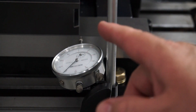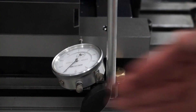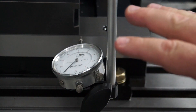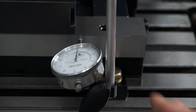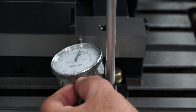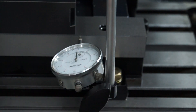I'm actually 0.6 of a millimeter out in parallelism in the x-axis. I'm going to work out which way to tap this and tap it back to zero, then recheck it. I've just given it a couple of little sharp taps, taking the weight off the dial, and let it come back to zero. So let's sweep to the other side now and see if I've corrected it.